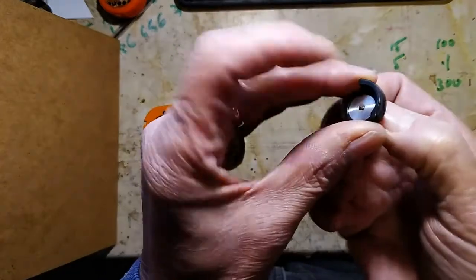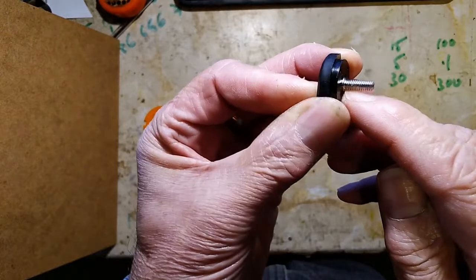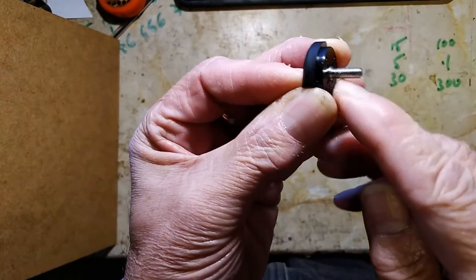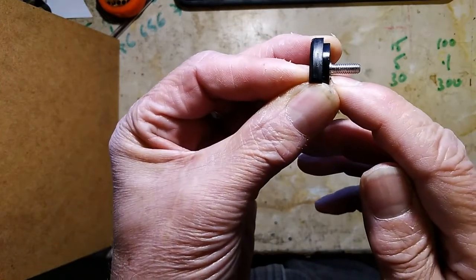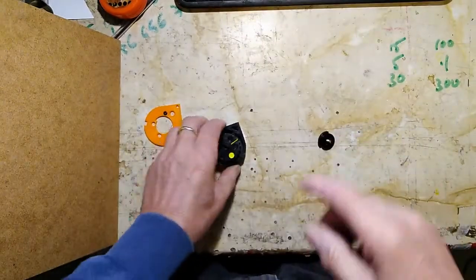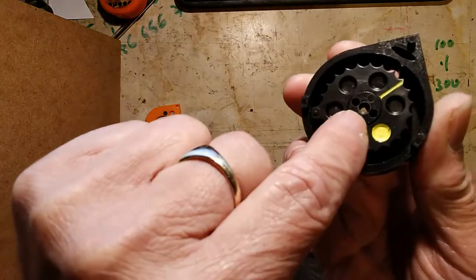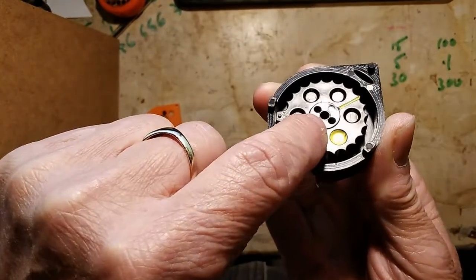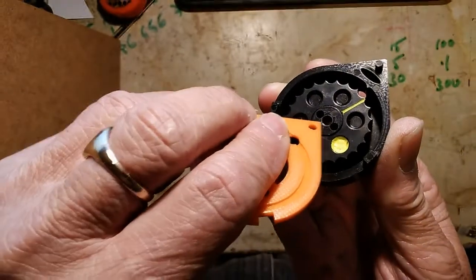And then keeping your finger pushed on there, if you turn it over, you should see that there's a slight raised lip or boss or whatever you want to call it of the actual silver stud, which sits, as you can see if I sideways, just sits proud. Now then, when that part is tightened into here, the part that you saw proud, the silver, should sit, let's get it in the light, there we are, onto this surface here.